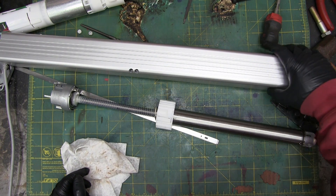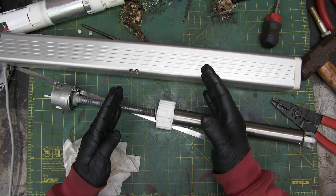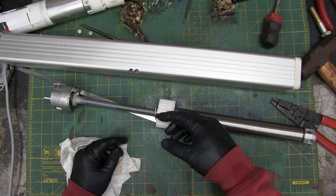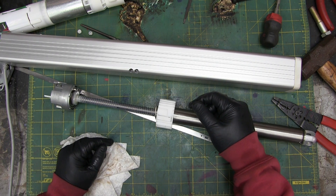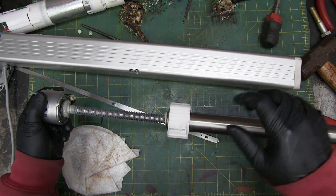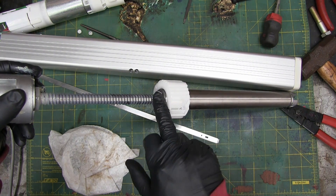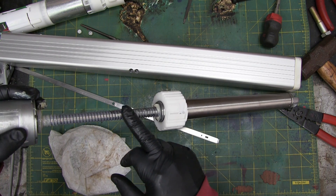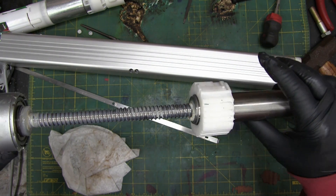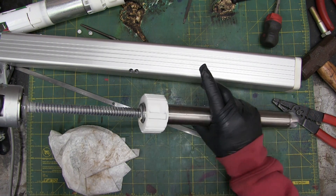In the end of the gland there's a plastic bumper. As opposed to a hydraulic cylinder — which has a different force retracting because you have to subtract the rod's surface area — this has the same force going either way. Because this is a ball screw, it has the same force in both directions. Very nicely machined. Some very high quality grease here — no molybdenum disulfide needed because the surfaces are very well machined. It appears to be some sort of high-temperature sulfonate grease, that white stuff that doesn't need red dye to look like it's actually doing anything.